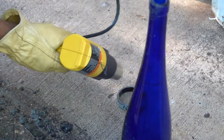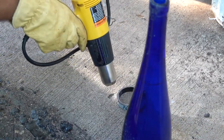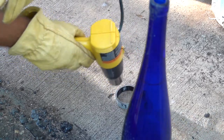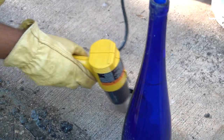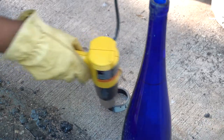In order to enlarge and taper this, I'm going to use a heat gun. We want to make it soft but we don't want to melt it. I'm wearing gloves because it is hot. Another thing — don't use the heat gun on the bottle itself; it could crack the glass and you could get hurt. Keep the heat gun moving so you don't get too much heat in one place.